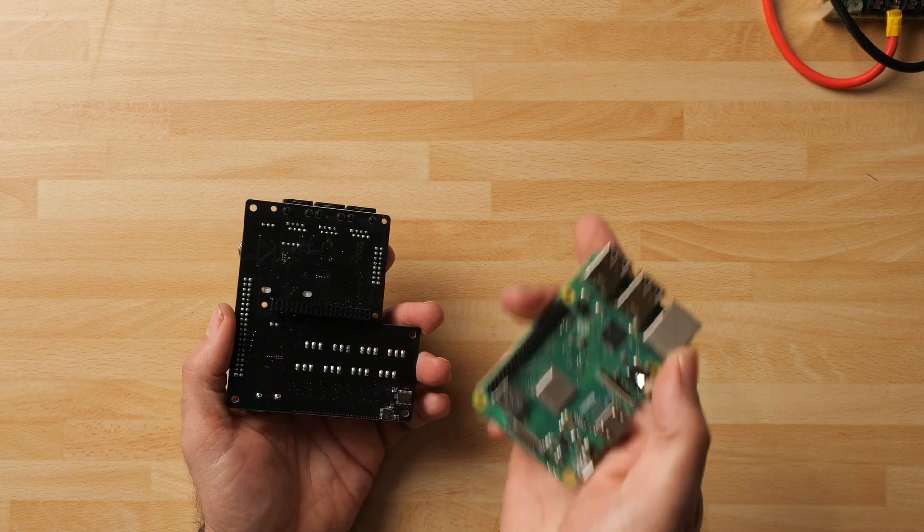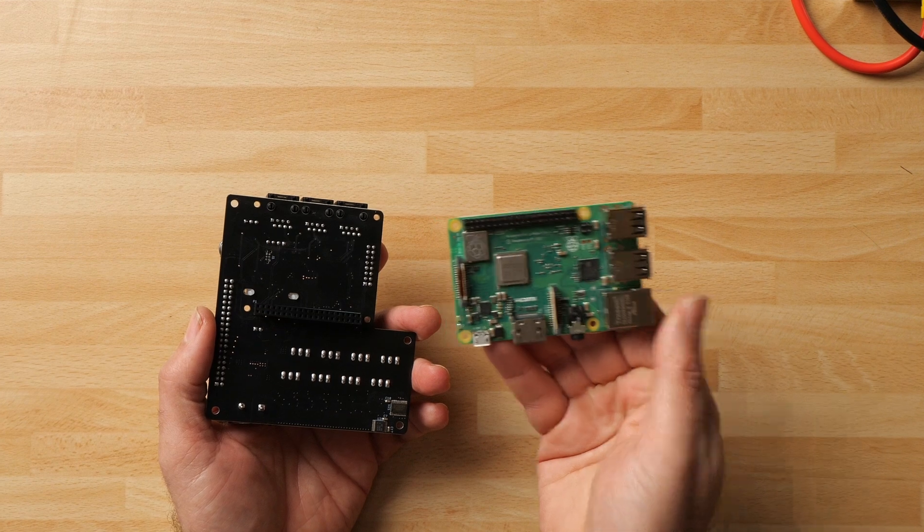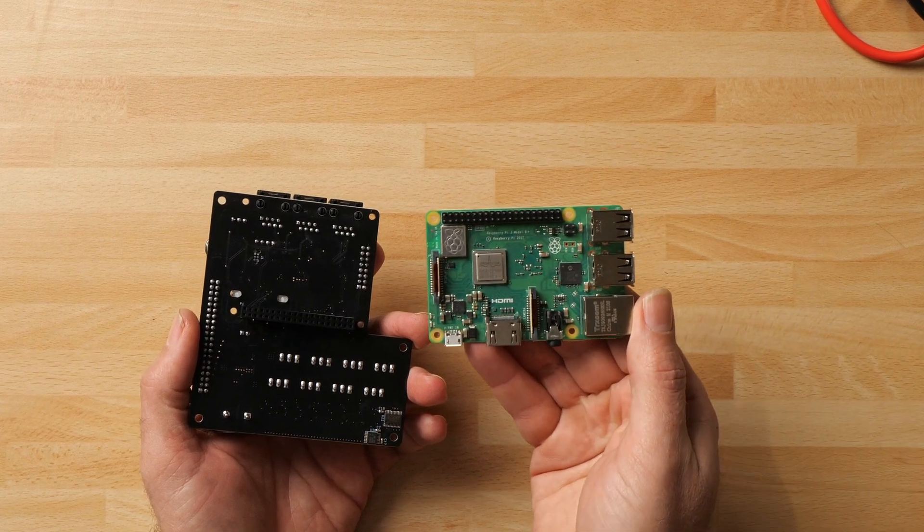I'm going to tip it upside down. I've got a Raspberry Pi 3B+ here, which is my preferred option for the lighting hobby. It has plenty of power for FPP and only one gig of RAM, but FPP won't use all of that anyway. There's no point going for a Pi 4 or Pi 5 with eight gig of RAM because FPP isn't that processor or memory intensive.